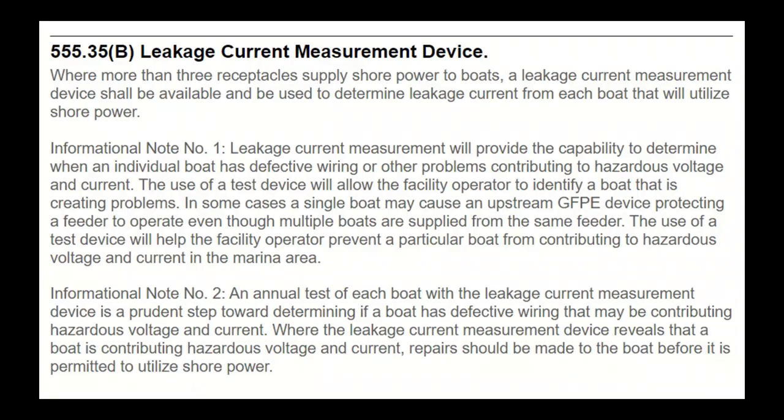So we don't have power. What I can do is unplug all the boats and plug them in one at a time — the one that trips is the problem. We cannot use this meter when there is no power; we have to use it when there is power. Then Joe mentioned that the manufacturer shows in the instructions that you can test it on the grounding electrode while the equipment is energized, and it'll check leakage there.